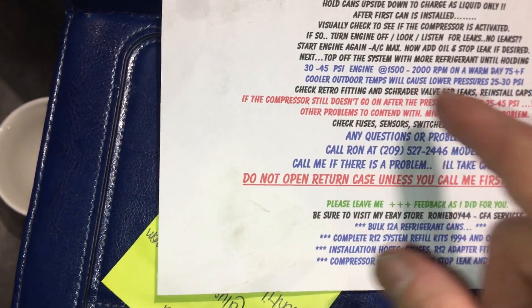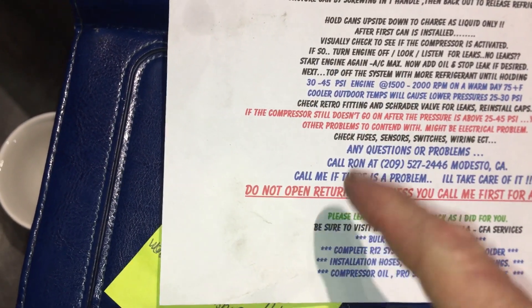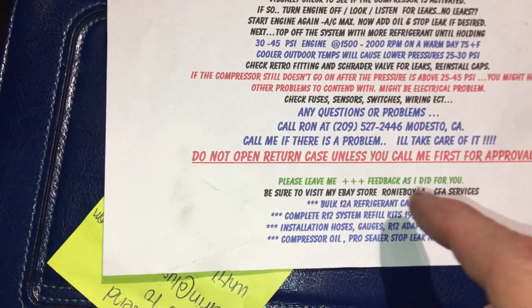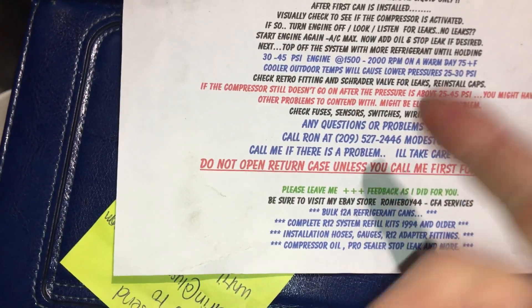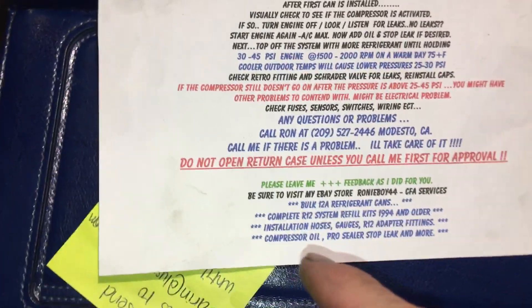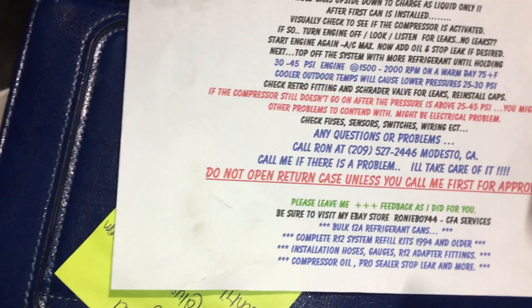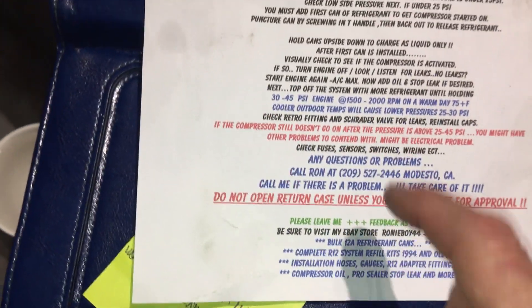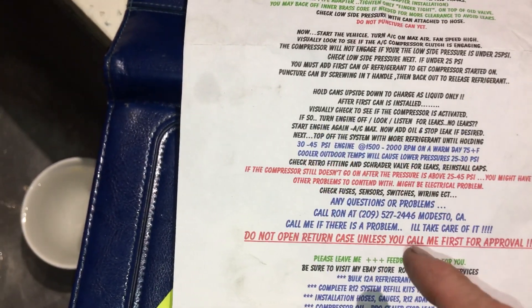This is the one I have on the vacuum pump all night long because they're not changing the receiver dryer, and it's a 1984 vehicle with all the original air conditioning parts since 1984. I think I'm doing this tomorrow — the vacuum pump is on this car and it's going to be on that car all night long. Let's see what happens.